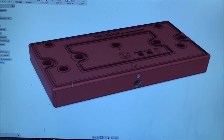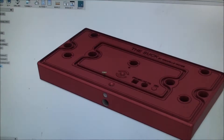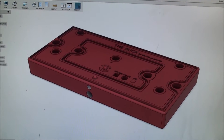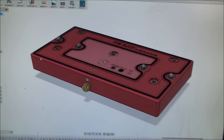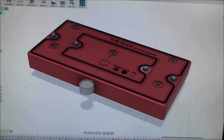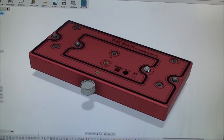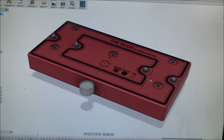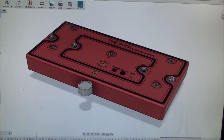This is what I'm working on. It's going to be a vacuum pallet changer similar to the VM300 made by Mighty Byte, except this one will be a little bit more specific to the Tormach. There will be two sets of locating pins on the inside and two sets of O-rings. These locating pins will hold a pallet 6 inches by 12 inches for smaller parts, and the outside locating pins will hold pallets that are 9 by 18, which is the working envelope of the Tormach.